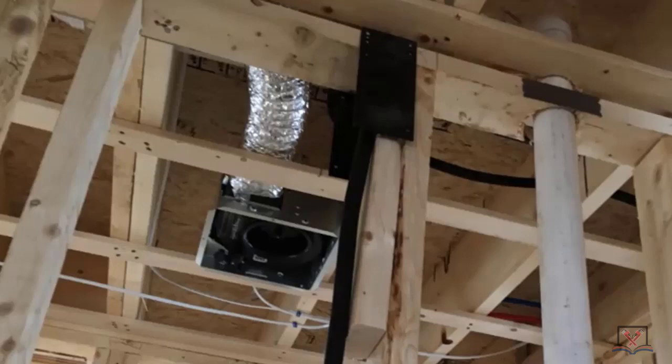You're also seeing on this image the product manufacturer-approved striker plate right there. That striker plate is not the same metal striker plate or stud guard plate material that you will see at a Home Depot, Lowe's, or your local hardware store. That is hardened steel right there. A carpenter, after sheetrocking, was going to put cornice molding up along where the ceiling meets the sidewall, probably nailing it off with a pneumatic nailer. A pneumatic nailer is going to send most nails right through the regular striker plates you buy at a hardware store. In this case, hardened steel — it's going to bend the nail; it's not going to go anywhere, sticking out of the wall. The carpenter is going to be a little irritated, but it won't go all the way through, thus not ever getting to the CSST.